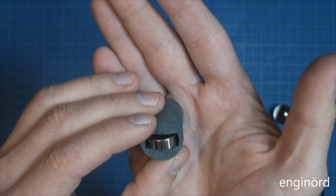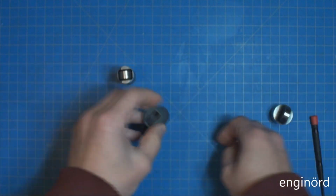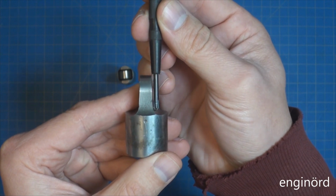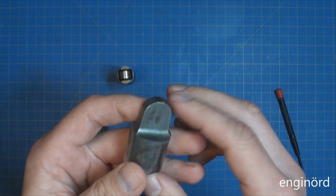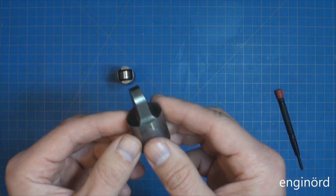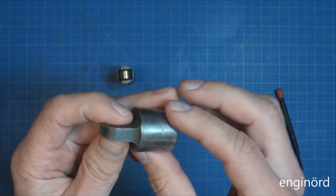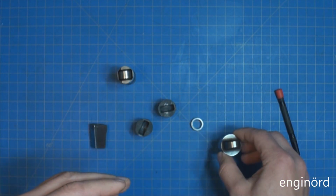So that worries me. I can essentially rework the tool and change this taper angle from 2 degrees to maybe 1 degree, but then I'm running a chance of locking the tool in, which I can help with lubricant. So I will need to find some kind of forging lubricant. I'm pretty sure there's something specially designated for forging, some kind of high temperature lubricant.